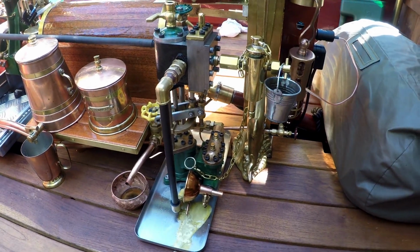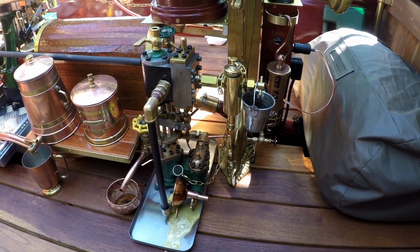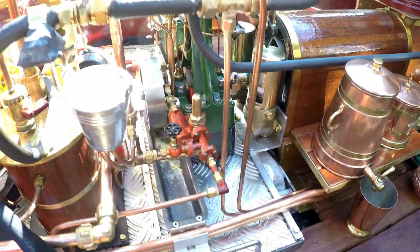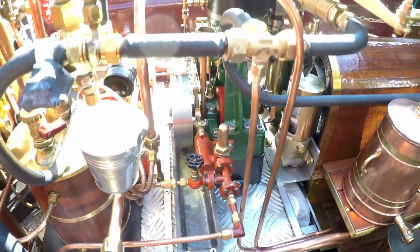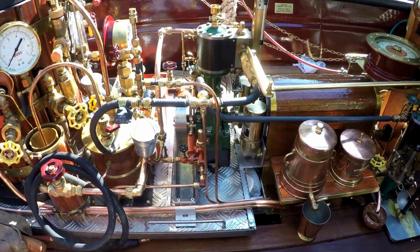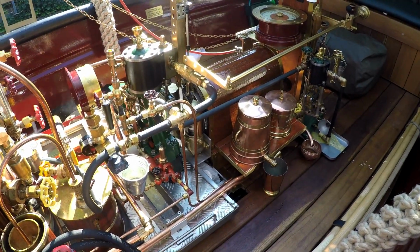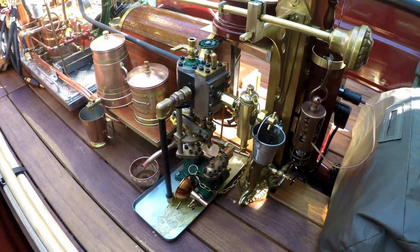This allows the start, a bit, to get rid of the water in the cylinder. The same is happening now with the Stuart 5A. So all the drain valves are open. The first movements of the machine. This is necessary to preheat the machine.